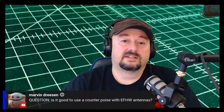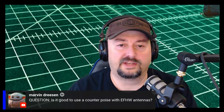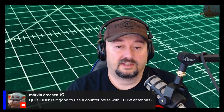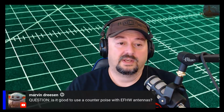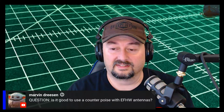The answer is yes. And here's what I don't get: a lot of times people are like, "Oh, that's an end-fed, you don't need it on that," but you do on a random wire antenna. They're the exact same thing mechanically and electrically, right? I think the difference is that an end-fed half-wave is a half-wave antenna, and half-wave antennas usually don't need it.